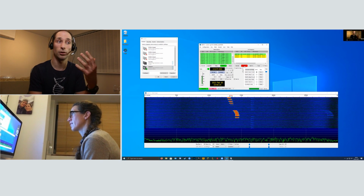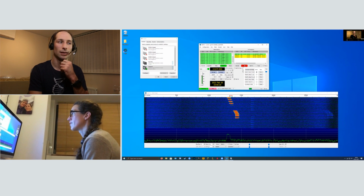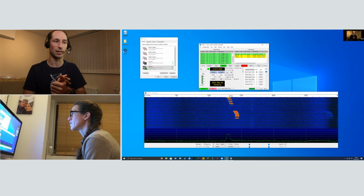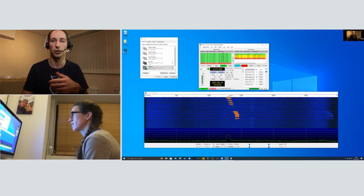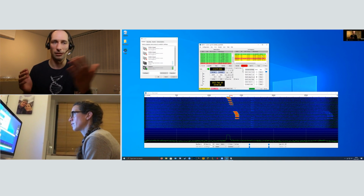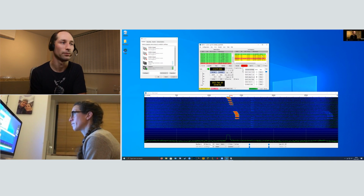That's great. So you've sent your first response, and in fact, I received it here as well. So I'm now sending my first message back to you, which is going to be M6JUT, M0VFC +29. That's giving you a signal report of +29 dB signal to noise ratio. That's a really strong signal. If we weren't so close together, it would be much less, and it could be into negative numbers as well.